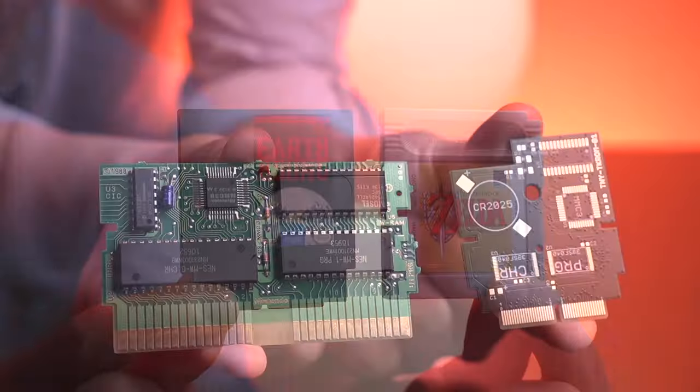And this pad here connects to pin 1 on our composite amplifier board. Lastly, we'll need to connect the VCC and ground of the composite amp to their corresponding points on the motherboard. Awesome. With all the soldering done, let's drop in our 18650 lithium-ion batteries and test everything out. Now you want to absolutely make sure that the polarity is correct when installing these, otherwise you risk frying the system.